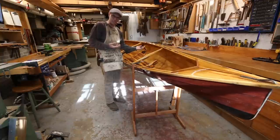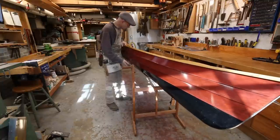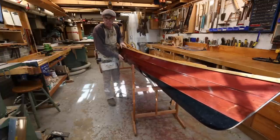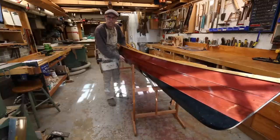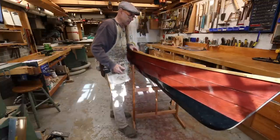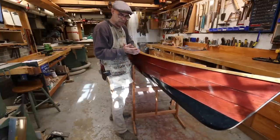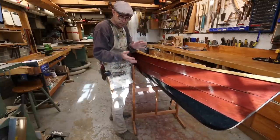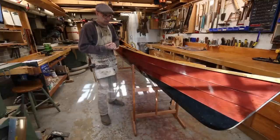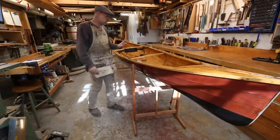This degradation shows on the inside but not the outside, and it's primarily on the planks that have black paint. On the shadier side that faces the house there's none of it except right near the ends where some raking light hits. So it must be the way the black planking heats up from that brief sunlight, just causing that plywood to want to move a tiny bit. I find that so curious because the topside planking doesn't show it at all.